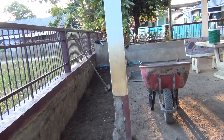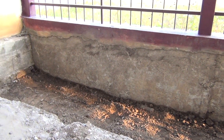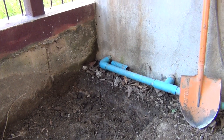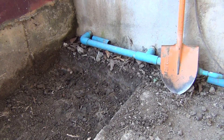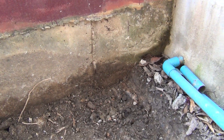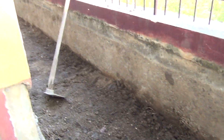It's all dug out all the way down to that end. The only thing left is to take this lip off of here, which won't take long. And right here I'm going to take a little section and dig down, fill it up with gravel so that if there's any water that comes in during a rainstorm, it can go along the site — I'll put a little dip in there, guide it down here, and let it go into the ground. All right, I'll show you when that's done.